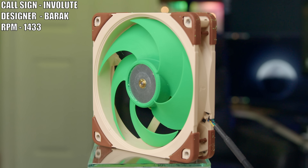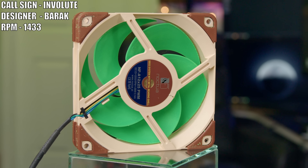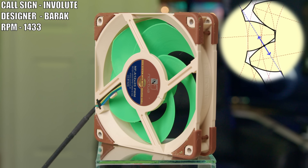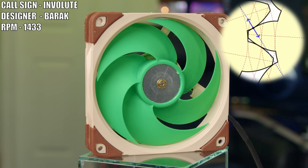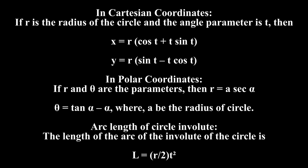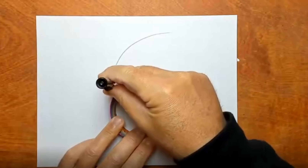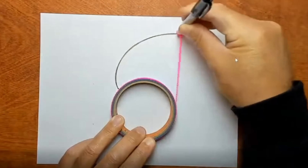The third fan of the day is the Involute, which was created by Barak. The Involute shape is something we all see daily — you interact with something using the Involute shape every single day. The Involute shape is used to create gear teeth. It ensures that gear teeth contact each other smoothly while maintaining a constant speed ratio, which is very important when transferring power efficiently — think of your transmission, a drill, anything. They also help minimize wear and tear over time. This shape can be defined with a mathematical equation, but it's much easier to understand using a piece of string and a marker. It's a type of curve created by unwrapping a taut line from around a fixed base, normally like a circle — you could think of it like the fan hub. The Involute fan blades follow this Involute shape.